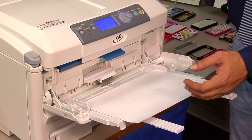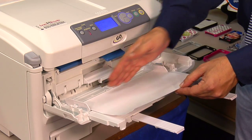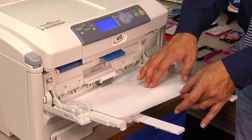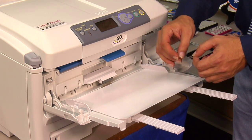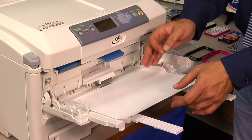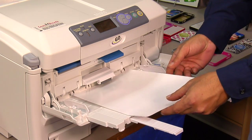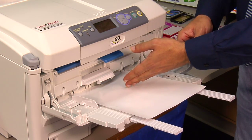As I had mentioned before with the Laser Imprints GoUno, the normal default paper feed is Long Edge, or the 11 inch edge inside the printer. But when it comes to Image Clip Laser Light, the emulsion layer on this sheet can be a little finicky and you might experience some paper jams if you try to do long runs with the sheet loaded on the long edge. Since we selected PostScript Custom Page Size and told the printer to run Short Edge First, I'll just change my orientation and line up the guide bars so I can feed the short edge through the printer.